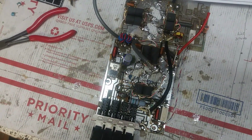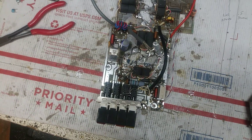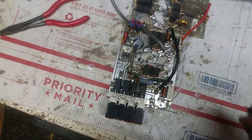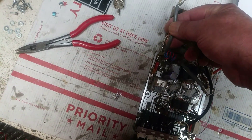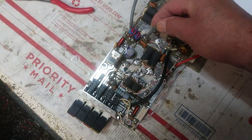I just dropped HGs in it and it worked great. So we're just going to go back with the values of a DX500, drop some HGs in here — should work fine. I'm going to change the power wires, probably going to change these two because one of them's burnt up. Nasty solder and iron — hack boy's been in it.